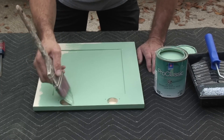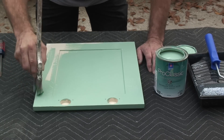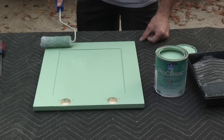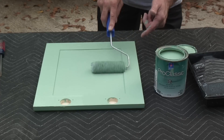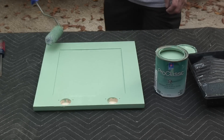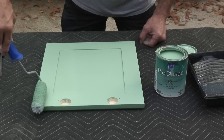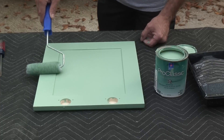Right now I'm not looking for a super gloss — I'm looking for a satin finish, one that's going to basically match the standard cabinets that come from the factory. I'll take my dry roller and just push it across here and it's going to get rid of all the brush strokes. Even though this is real smooth, you'll have small brush strokes, but if you take this and roll over it with a dry roller, it gets real flat. When it lays down like this paint does, it's going to lay down like a spray. That's all there is to it.